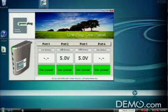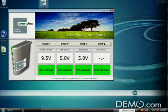Further, when I unplug the device, the power supply immediately knows and identifies the device has been disconnected, and cuts power to the port. Next, I'm going to plug in a digital picture frame, which requires 9.5 volts of power. I'm going to plug it into the exact same port, which you remember was previously programmed to 19 volts. Plug it in. Collaboration begins. The power supply knows it's a digital picture frame. The same exact port goes from 19 volts, programmed to 9.5 volts. So as you've seen, GreenTalk and our UPP chip enables unprecedented collaboration and monitoring of power supplies and their electronic devices. Thank you, and I'll turn it over to Frank.